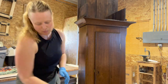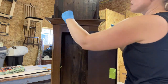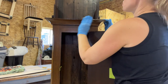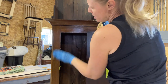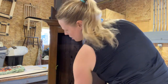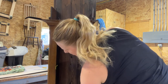Contrary to what you might believe, or maybe what you've heard about a wax finish. Same thing with oil finishes. Not a lot of them, unless you're getting into the varnish side of things, have a lot of protection against moisture. And they need to be reapplied very often. That's why we have our film finishes that we use, which is lacquer, shellac, varnish. Those finishes protect the wood against moisture and seal in a bit of moisture from getting out of the wood as well.